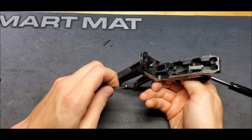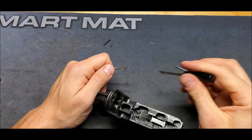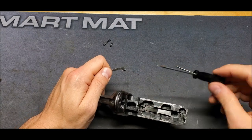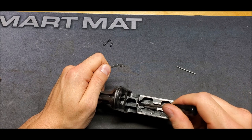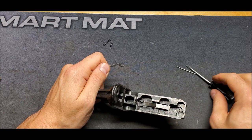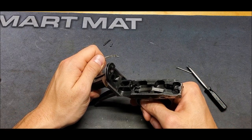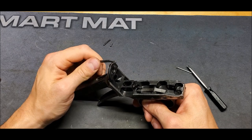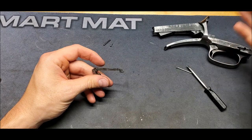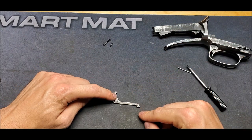Yeah, so that gave it clearance. So this foot on your timing rod is in this slot here, but it's also up against this wall at the back of your guard. So you just need to have your safety off, pull your trigger so that moves up, and then that gives it enough clearance to come out from behind that wall. So there's your timing rod operating lever,